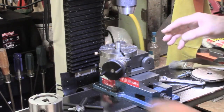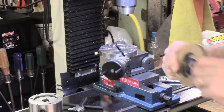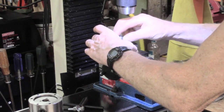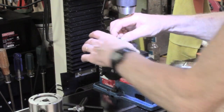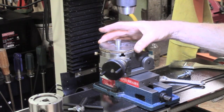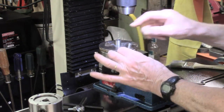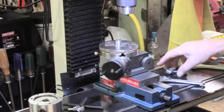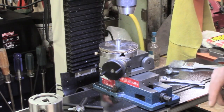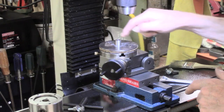So then taking the chuck off, I then got to get the plate. I've got some packing under there which should be enough. What I've got to achieve here is I'm going to have to try and get this fixed — I thought I might manage to just nip it down at the edges but it's no good. I'll have to make the T-slot slots in this first, which I'll probably do crudely by grinder, because I've got my X and Y set up now ready for getting the three-hole pattern on here.